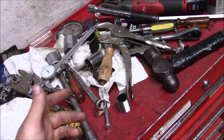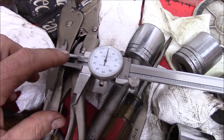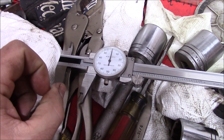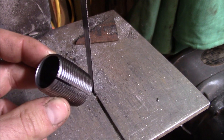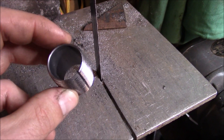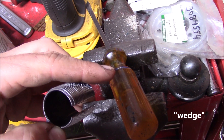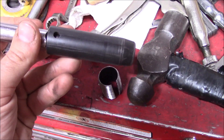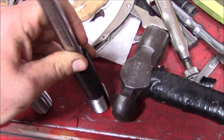Schedule 40 standard weight. You've got to size the OD to 1-1/8 and the ID to 7/8. However, the 3/4 inch is slightly smaller than that, so you take a slice out of the side, spread it apart a little bit with your wedge, and then find a random socket to drive through there to kind of swage that open.